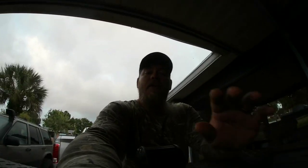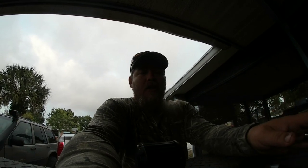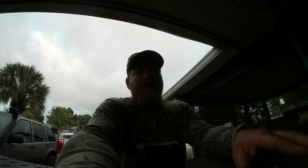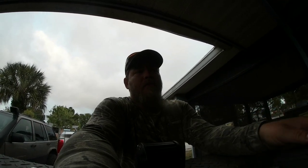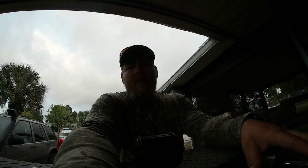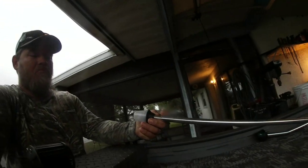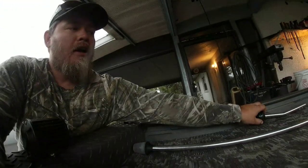We're going to go ahead and do a review on the Alweld 1544 Mud Series hull. It is a 15 foot long by 44 inch wide, tapered chine, 0.100 aluminum. Floors, decks, the sides, everything's 0.100. It is foam filled. It's mostly an open hull plan. It does come pre-wired with pretty decent lights.